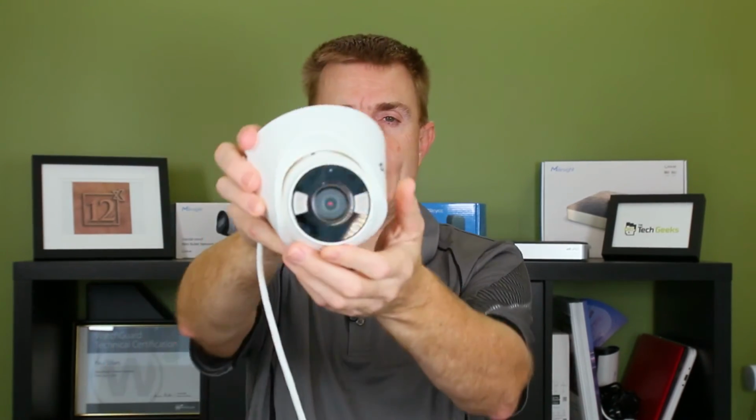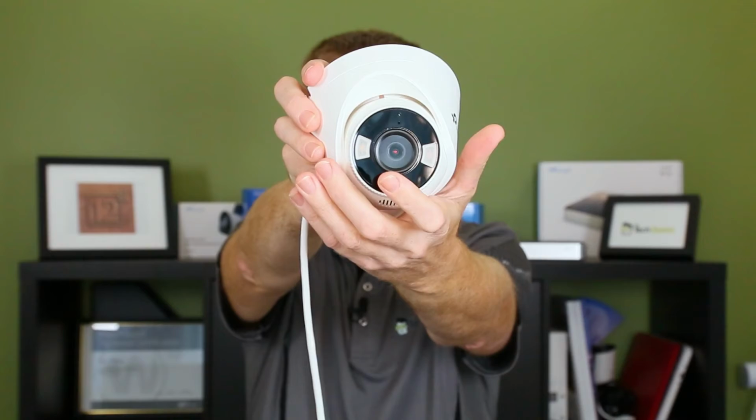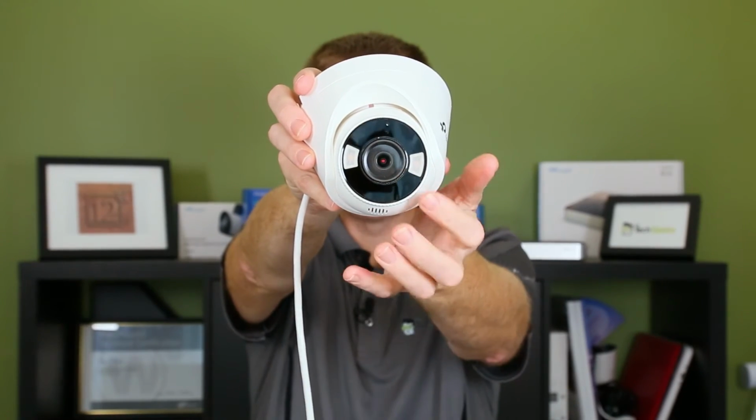You're probably at the front here. Let's have a little bit more of the camera. We can see our LEDs, and we've got infrared on this, and we've also got white LEDs. The idea being that you can set those LEDs to come on at night time. It will give you maybe 5 meters or so of white coverage light, which then allows you to record back a color image. You can tell the lights to flash if something's happened, like somebody crosses a line, or it detects a person or a car. So again, quite a lot of defensive options that make these visible, so that people can see that you have some sort of cameras around.